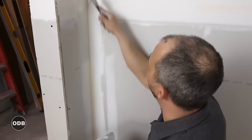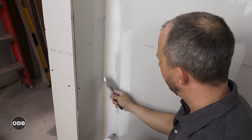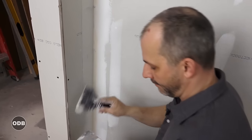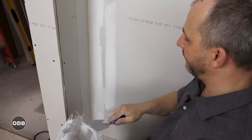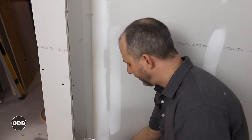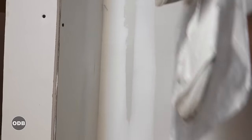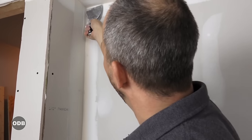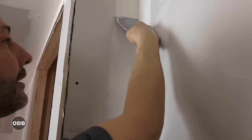This is one application where you don't want to use the side of your knife, because you want to set up mud going from zero to cover over that four inches. Keep your tools clean as you go. What I want to do is use pressure on this knife — I'm cleaning this mud as tight as I can and leaving the ridge. Now I'm going to change direction because when you're doing finish work, you always come towards your finish work. I'm going to trough out the inside corner with my knife, then when I put my pressure on, it'll fill it up and finish flat without any excess.